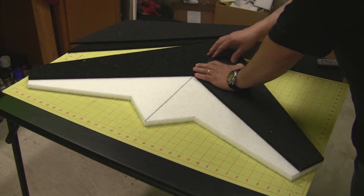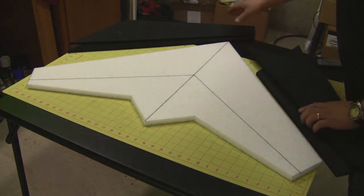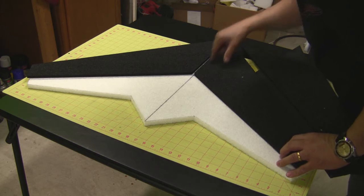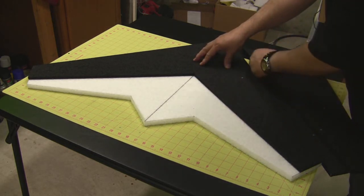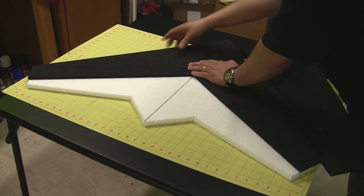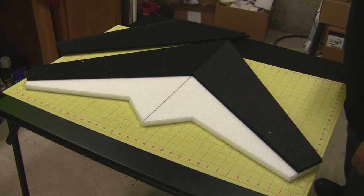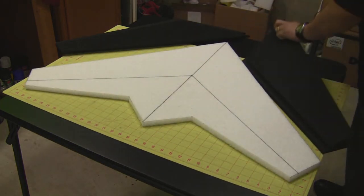If you do have a gap, take one of the sanding blocks and sand along the edge a little bit until you get it to fit right. Go ahead and try to fit both sets to make sure they both fit. As long as they line up on the center line and the trailing edge line, it doesn't matter if they overhang a little bit on the leading edge at the front or at the outside edge of the wing, because we're going to trim that later with the handheld hot wire. As long as they fit with no gap in the seam and on the lines, we're not going to glue the KF airfoils on just yet — there are still a few things we need to do before putting them onto the wing, so set them aside for now.